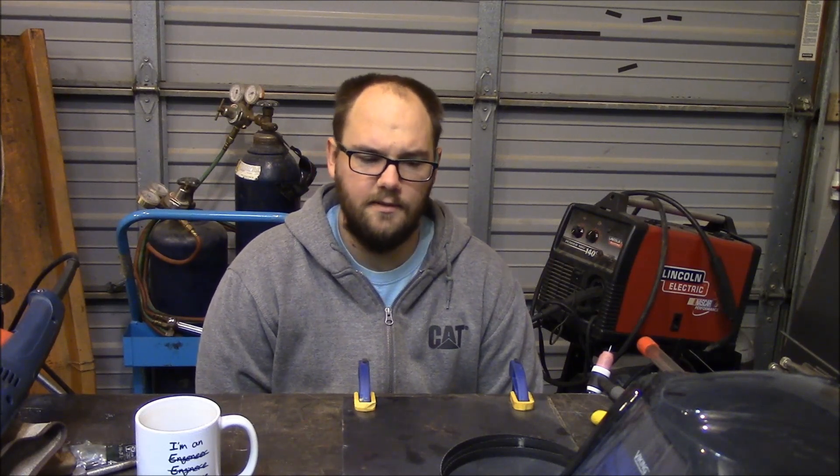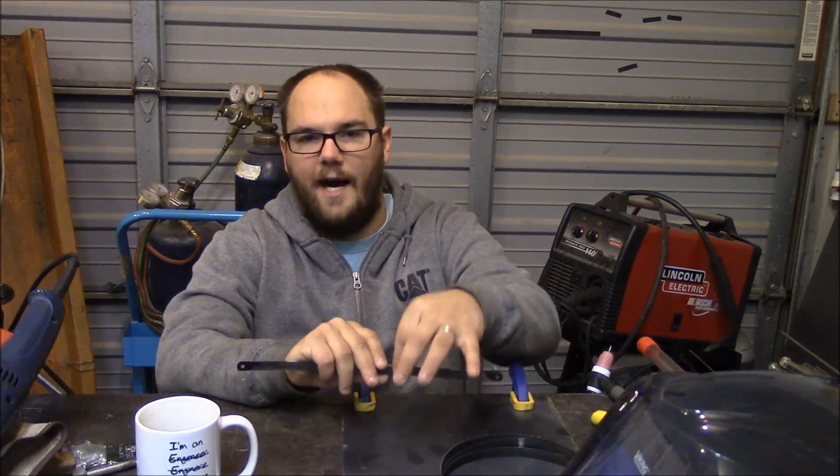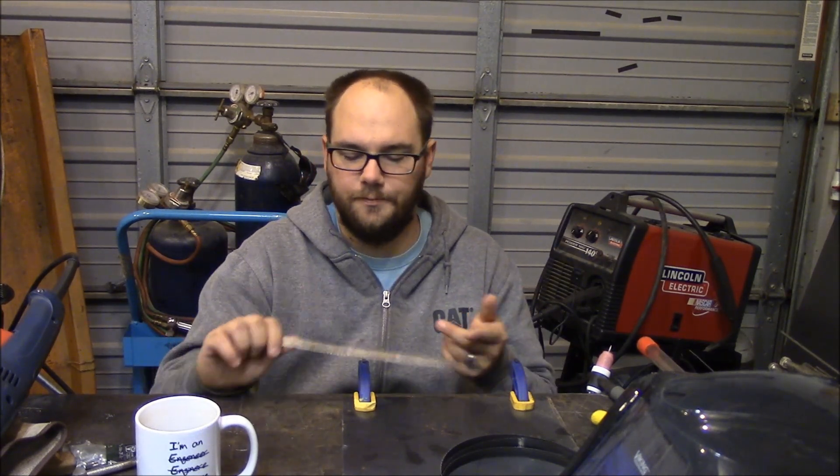It's a high carbon saw, not a bimetal saw. I'd recommend the same process for a bimetal saw too, because they're typically high carbon as well. Bimetal just means the teeth are a tool steel - typically M2 or something - and the spine, which is more or less the top seven-eighths, is another high carbon steel like 1095. If you look at a bimetal saw you can actually see where the weld is between the two different metals.